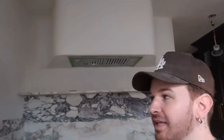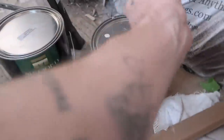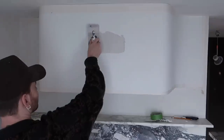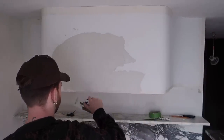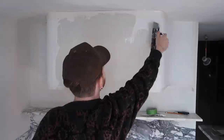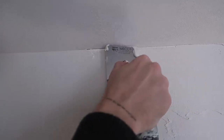It's time to plaster — I'm excited and a little nervous. Look how beautiful the form looks! The plaster application is going to be the exact same technique done on the walls — just using the trowel and smoothing it once it gets a little dried down. I grabbed the product in gallon form today — two gallons to finish off the range hood, plus one more coat needed on the underside of the arch. I'm using the same plaster on the front of the vent hood, getting it right up close to the edge and nice and smooth along all the corners.